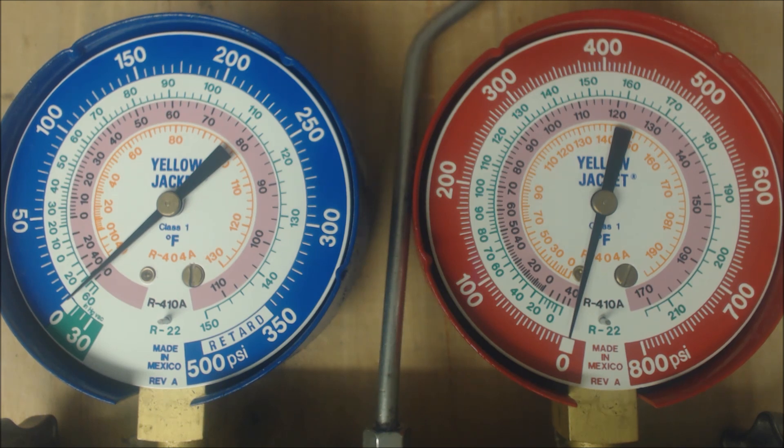Therefore, you possibly have an air blockage. A couple things the air blockage could be: dust on the return side of the evaporator coil, too low of a blower speed, a blower motor or horsepower sized too small, dip switches not set correctly on an ECM motor, a clogged filter, undersized ductwork on the return or supply, a duct restriction, ductwork collapsing in on itself, acoustical liner, or a piece of duct liner that has made it to the bottom of the evaporator coil and is clogging it up.